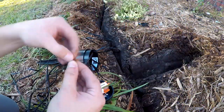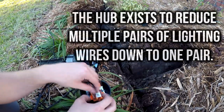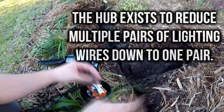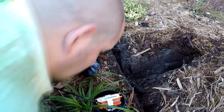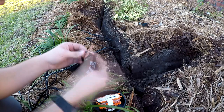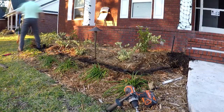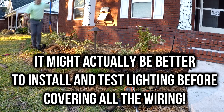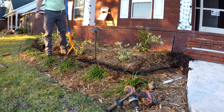With this Volt Kit, they install these lighting hubs. Basically, your landscape lighting consists of a light with two wires — one wire goes into one side of the hub, the other wire goes into the other side. When they're all connected, you just have one wire running from the hub to the control box, rather than eight or ten wires for however many lights you have. Once all that wiring is run and in the trench, cover up the small trench — which is pretty easy since it's small — and rake your mulch back into place.